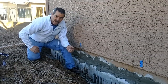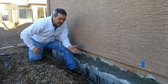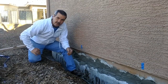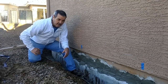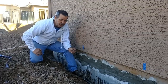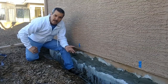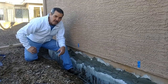So, what we've done — we've pulled that patch off, which is already breaking, chipping, cracking, and flaking. We exposed the rebar, removed a section of deteriorated rebar, and installed another piece in its place, because it was just deteriorated too far. But if you don't use the proper epoxies to stop the oxidation process of the steel, nothing that you put on here is going to stay — it's always going to pop off, it will never work. So you have to have the right recipe to do this.